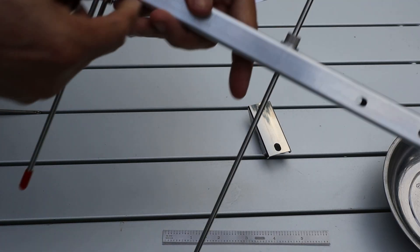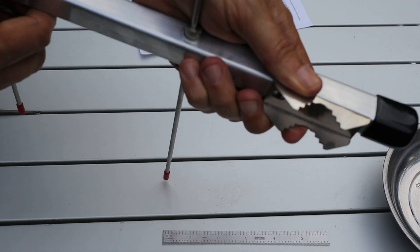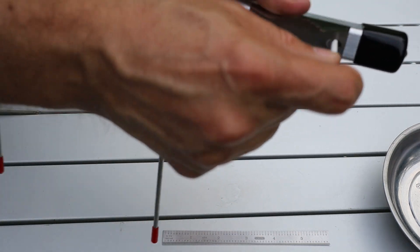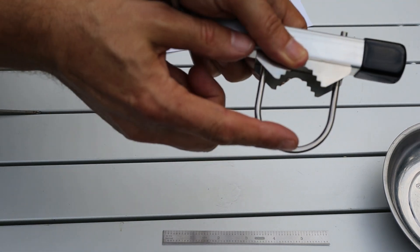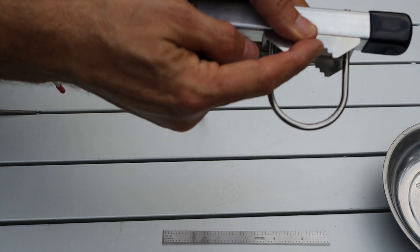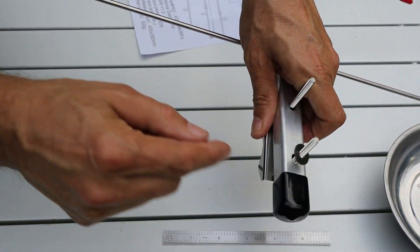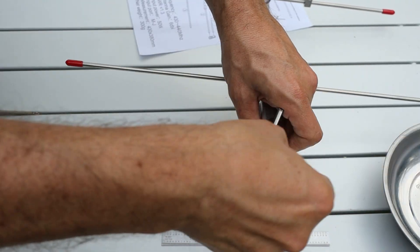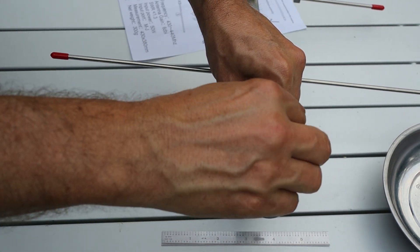The only thing left is to install the mounting hardware on the end of the antenna. I bring in the clamp toward the mast side, then bring in the U-bolt so the mast clamps between the U-bolt and the bracket. I'll install the hardware loosely for now — flat washers first, then lock washers, then the thumb screws — until we get this up on a mast.